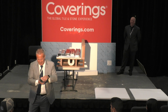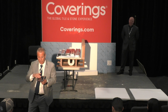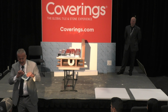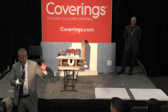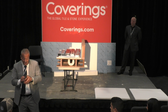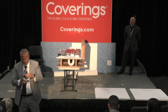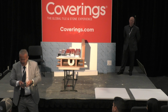This is actually a finish. It's a polished finish, so you can use this. It'd be visible. You just lift the feet. Otherwise, you can use the same thickness of tile or a different thickness. So let's say you have large format outside and you want to use a glass. You can still do it because you are adjusting the height like this, and you don't have to worry about it. There are no adapters that go outside of the cup. Everything is inside of the drain, so you can come up and down as you want.